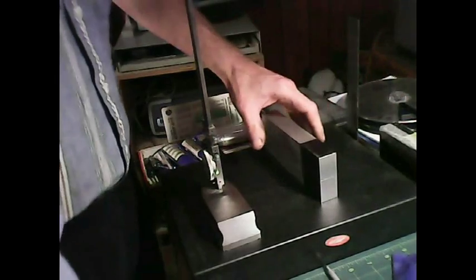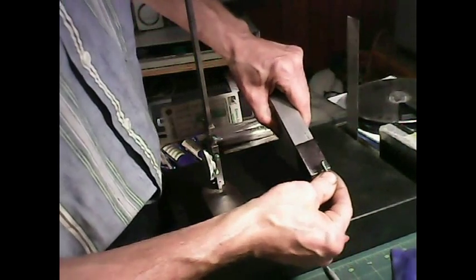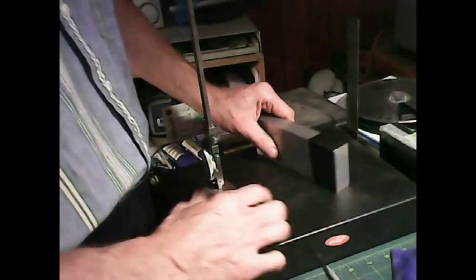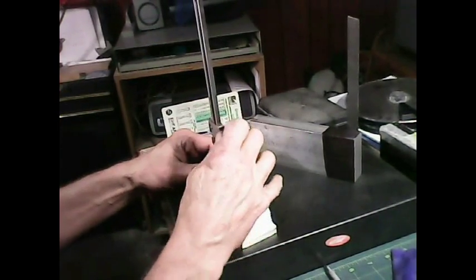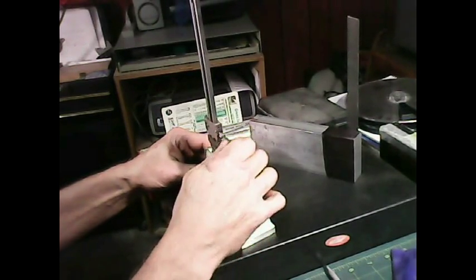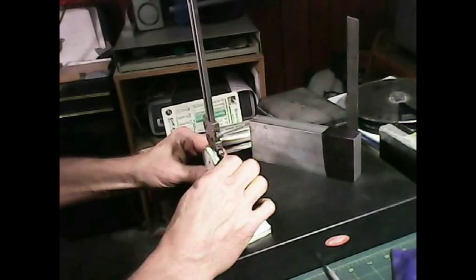The head of the screw itself is about roughly 150. And so the 3/4 bar will be 1/8 inch past that. I think I'll get about 1/8. So 150, I'd say probably 300 thou would be a good setting to start the diameter. So I set this at 300 thou.